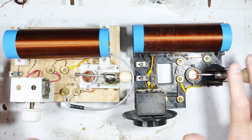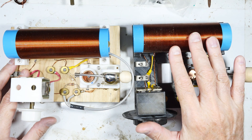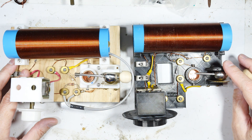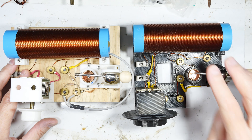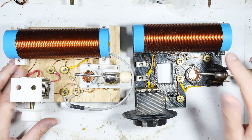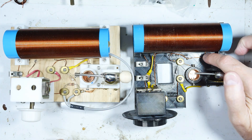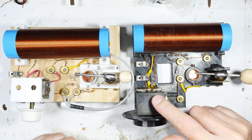The capacitor is the same, everything's the same across the board, except that when I got done, this one did not work. It didn't even give me a crackle when I was adjusting the crystal diode. So I went over it with my meter, checked all the points, and checked the solder joints for a cold joint all the way around the board — and nothing happened until I got to here.